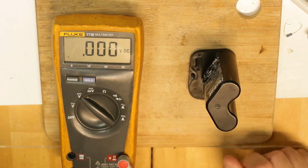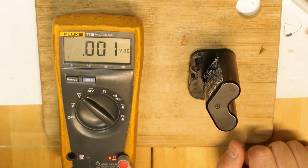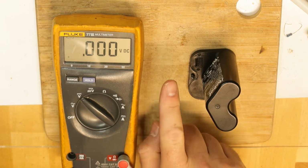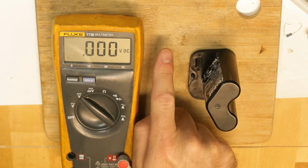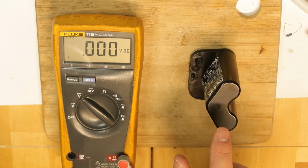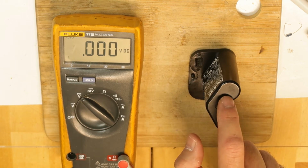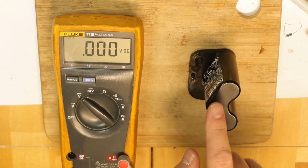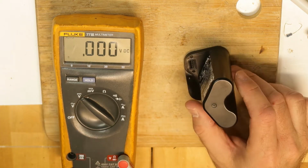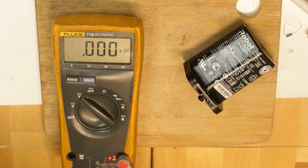enough contacts. You need exactly 4 contacts if you want to do the balancing, because you have to connect the total plus, the total minus, and then 2 points in the middle, first after the minus, let's say it is here, and then after the second battery it is here. So you need exactly 4 contacts, and the BMS can be in the other unit of the iRobot.